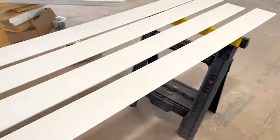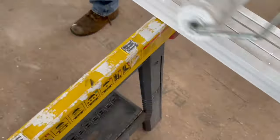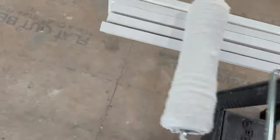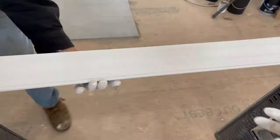When I first purchase the trim, I like to take sandpaper and sand off any humps or bumps on the surface of the primer, then wipe it off thoroughly. Then I put it all in a bundle and hit the edges so I don't have to cut the back of the trim later when it's installed up against the wall. After I apply the paint to the side, I take a brush to smooth out any runs, then lay the trim across the workbench and run the brush over it one more time before applying a coat of paint using a roller.